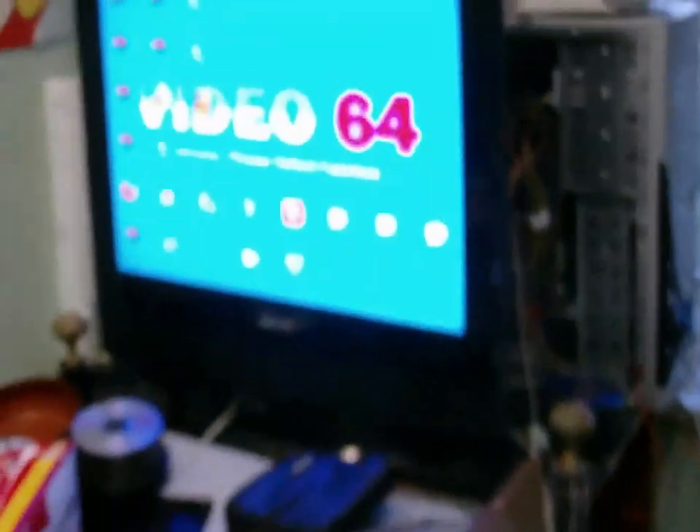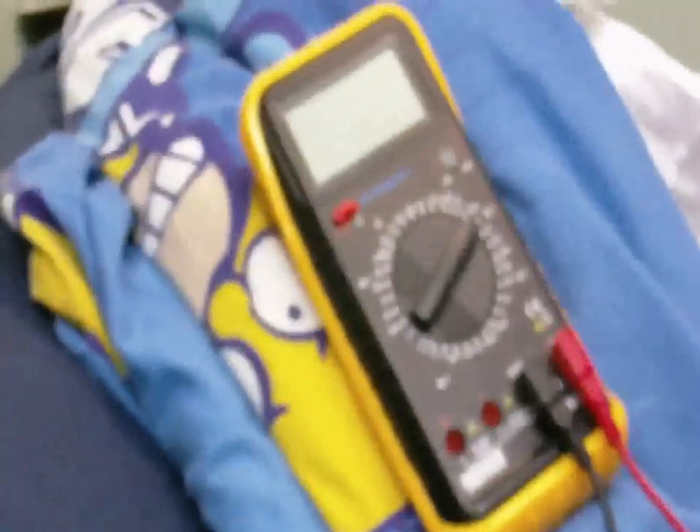Now although that works, there is quite a high voltage between the negative terminal on the connectors and the sockets. And I think the reason for that is because all this stuff here is wired up to a plug that goes behind those cabinets there, and the computer and everything over here is wired to a plug behind my bed — so they're connected by two separate earths.